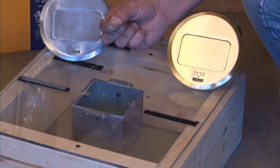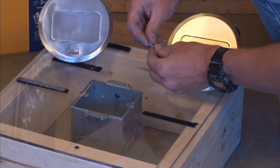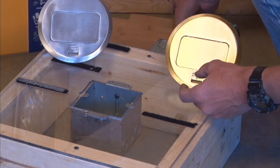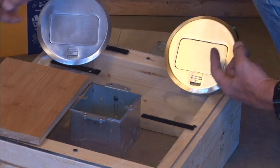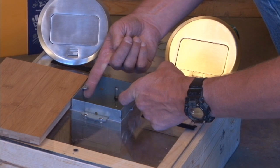It comes complete with an Allen wrench and two set screws that allow the box, when loosened, to adjust to the finished floor depth. Here we know we're going to be putting in hardwood, so we set that in place and we simply loosen the inside screws, then pull the box up to the finished floor depth.